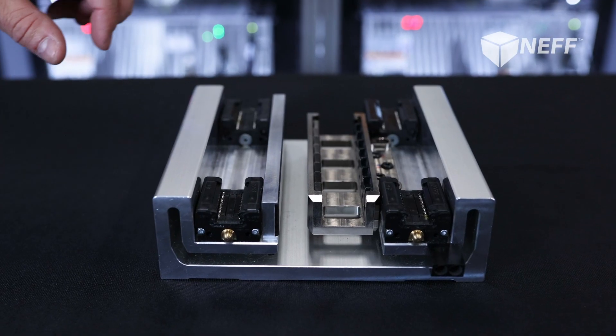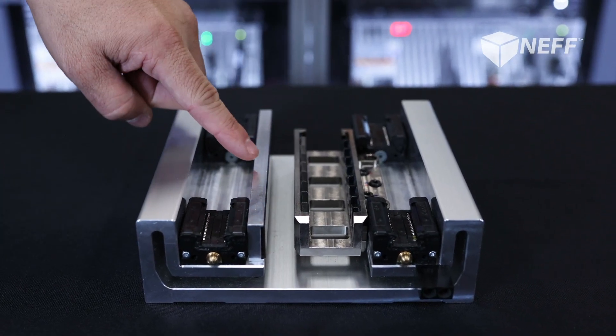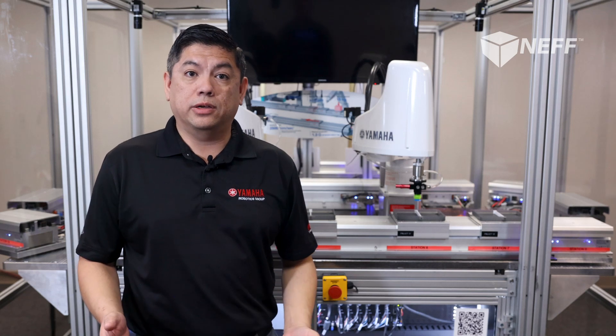Panel builders, you are welcome. The pallet construction is very simple and made up of a robust THK recirculating ball bearing with wipers, magnets, and a reader strip — all of which can be rebuildable and replaceable. Since there are no moving parts, the only maintenance required is just lubricating your THK bearings every six months. No belts, chains, gearboxes, or ball screws to maintain.